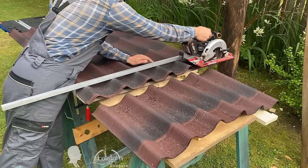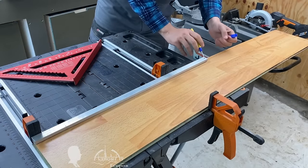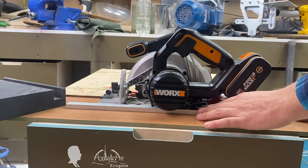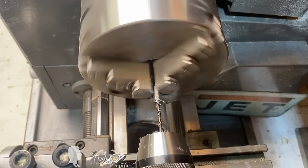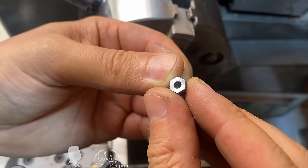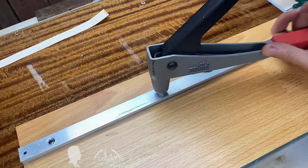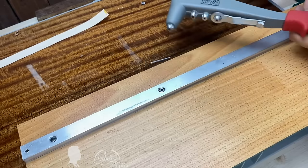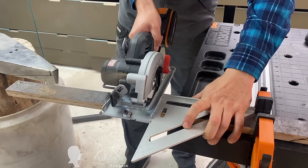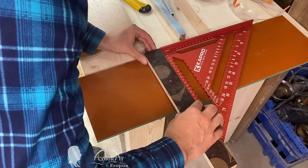However, this saw guide has its drawbacks — it cannot be used without securing it with slot clamps. So let's move on to creating a full-fledged guide rail from a piece of laminate flooring and an aluminum profile of 20 by 10 mm. This profile fits under the motor housing of my hand saw. I will fasten the profile to the laminate using pop rivets, but a small bushing will be needed for this. I turn it from a broken bit, drill the hole, and cut off the excess — it is good to have a metal lathe at hand. With such a spacer, you can install the pop rivet through a small hole, fixing the profile on the laminate quickly and neatly.